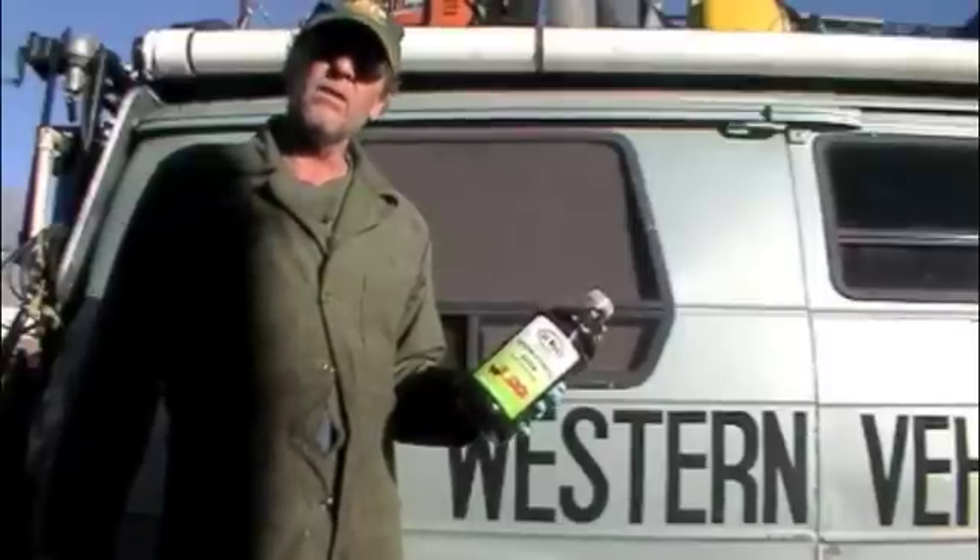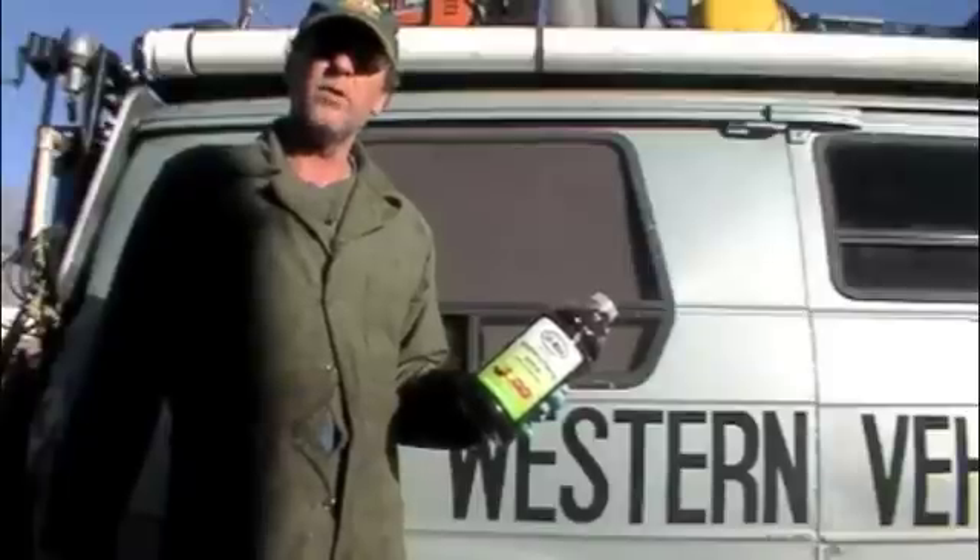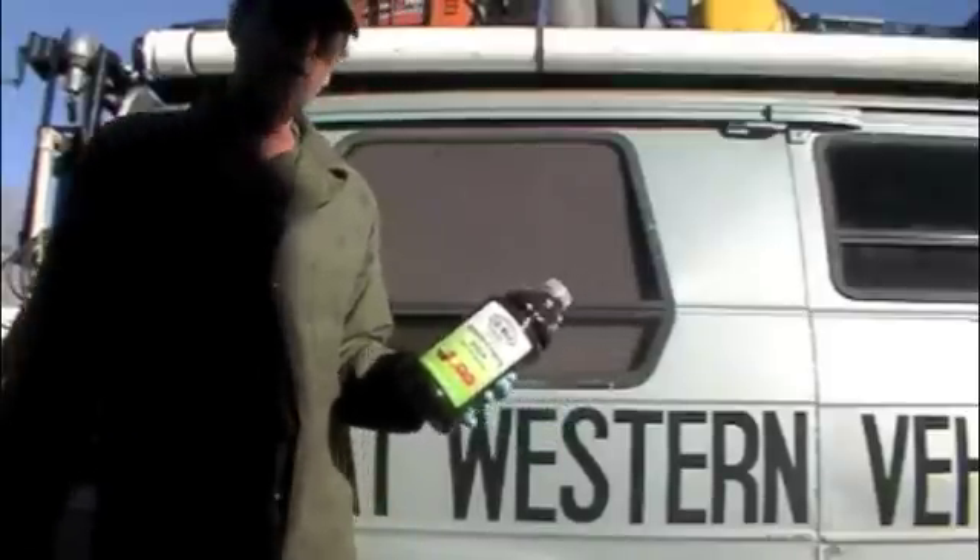If you don't filter down to 1 micron then you'll probably go through more fuel filters, but your fuel filters aren't going to plug up too quickly using that simplified process. This is a sample of the waste oil blend diesel fuel we made out of some waste vegetable oil. It's sat for a day and hasn't even been filtered down to 1 micron — it's only been passed through a few screens and settled and separated at three stages. As you can see, at the bottom of the container there is no sediment whatsoever, so we can say that simplified filtering can work.